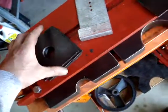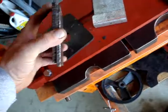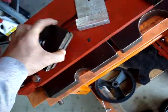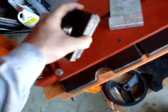It's a handy way to use that Swag Off Road lower die to get small, thin-gauge, tight little bends. Depending on how you stack your quarter-inch plate, you can get a quarter-inch J-bend, a half-inch J-bend, or the one I needed — three-fourths of an inch. Anywho, that's a handy way to create brackets without having to go buy them. I'll talk to you later, YouTube. Bye.